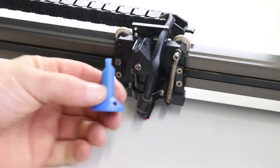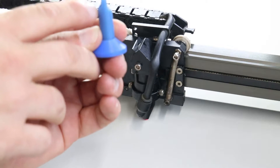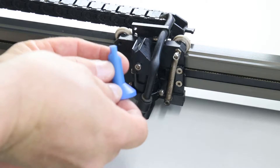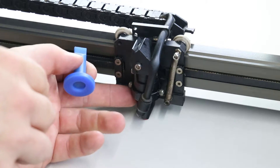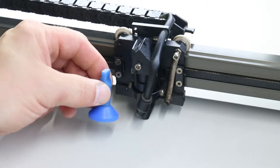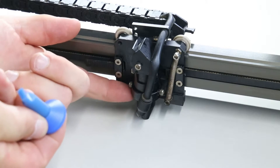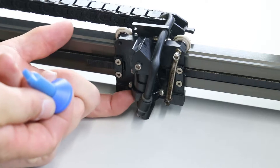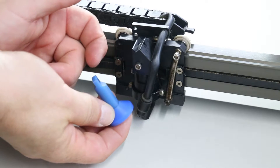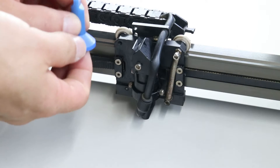This small tool has two sides to it — we're looking at these shapes here. It's got a high elbow and a low elbow. When we're setting the height, we always use the low elbow, because we've got extra air devices added to the cutting head which makes the cutting head a little bit longer. What we're trying to do is to get this elbow effectively seated on this edge — there's a step out just here, and we try to get it snugly into that angle.